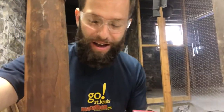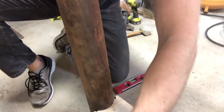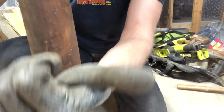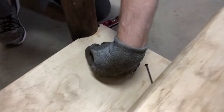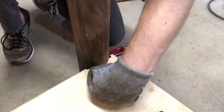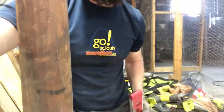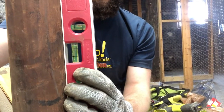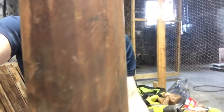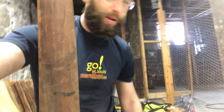Okay, so I was shooting screws in from this side and also from this side. When I shoot a screw in from this side it pulls the newel post this way, and from the other side it goes the opposite direction. I was just able to adjust its plumbness - I screwed a screw in from the inner side and it pushed the newel post over appropriately. Now when I'm looking at my level, the bubble is going in opposite directions by the same amount, which is due to a little bit of a taper on the newel post - but it is plumb, which I'm a little surprised about.